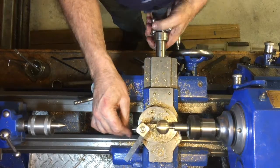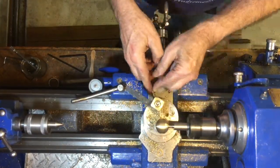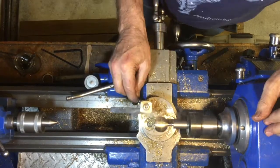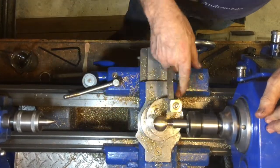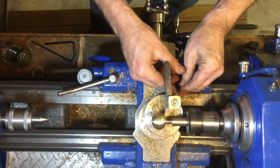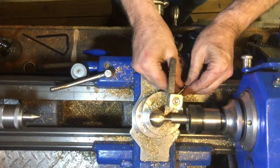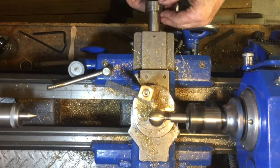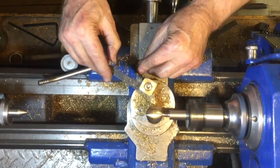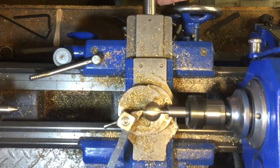That would make it less bulky and easier to get into the corners. The difficulty I had was that the insert is screwed on with a 2.5 millimeter screw with a pitch of 0.45 millimeters, and I didn't have a drill and tap that size. Instead I used the tool holder. I could also use a triangular cross section for the tool post rather than square, with the angle matching the carbide tip. When cutting, I found it worked better moving the tool from the pole to the equator of the sphere, at times moving the cross slide away from the work to reposition to the pole, then readvancing to make the next cut toward the equator.